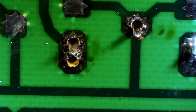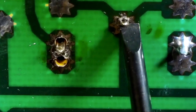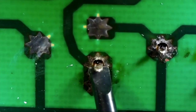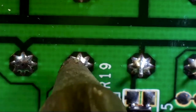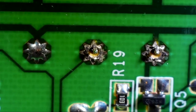You can see it sucked all the solder out — there's really no solder left in there. That's one reason I use the Hakko desoldering gun: it sucks all the solder up so I don't have to worry about wick. Now if there's a little solder left over, I take a screwdriver and push on the pin this way — if there's a little solder bridge it will disconnect. That's what you do if just a bit of solder is left and it's not coming out.